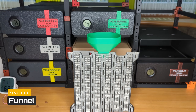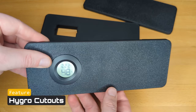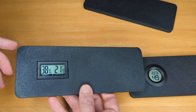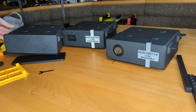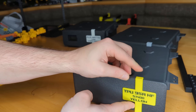This means you can bake the entire compartment in an oven at around 100 degrees Celsius to recharge the silica beads, saving you the hassle of pouring them out. To make filling that compartment easier, I even designed a small handy funnel to prevent spills. To know exactly when it's time to recharge the desiccant, I included cutouts in the lid for both round and rectangular hygrometers, making monitoring quick and effortless. Since the boxes are opaque, I added detachable label plates. Pro tip: you can simply print these plates using the exact filament inside the box, giving you an instant visual and color-coded inventory.